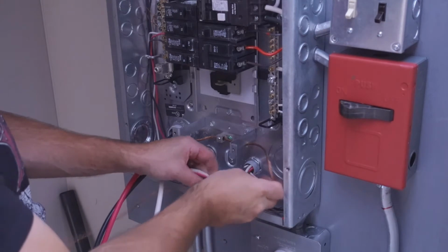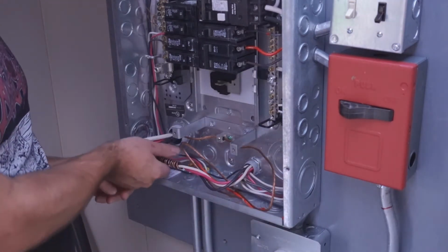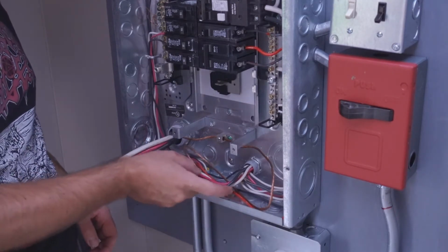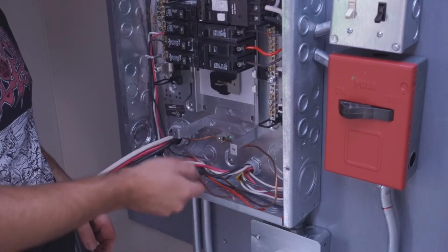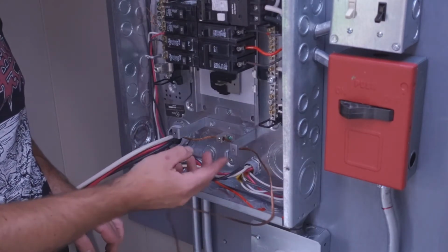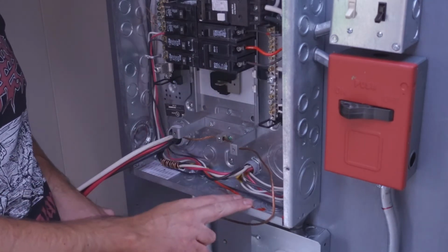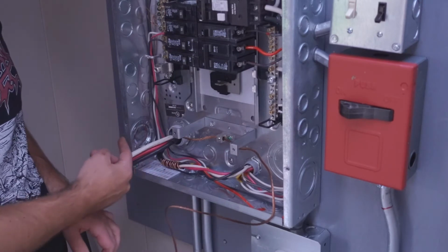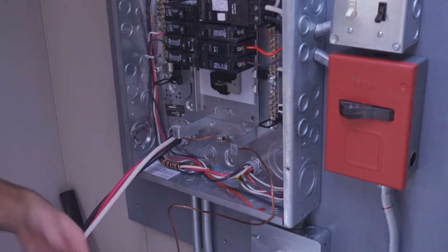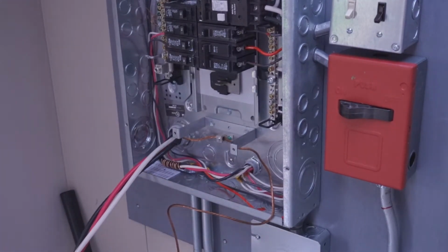I'm gonna tuck this away. Before we get too into it, I want to wrap this, right? So this is that switch wire, the 14-3 switch wire for the three-way switch for the yard light. And so the switch itself is grounded through this system. Everything else is grounded through this system. This wire is grounded to the house. I don't want two grounds, so I lift this ground, in theory. At least that's the way I'm trained to do things in my line of work as a technician.